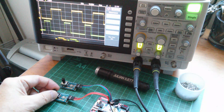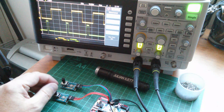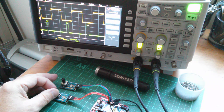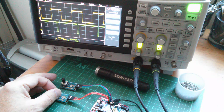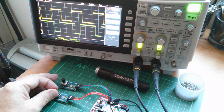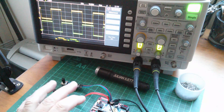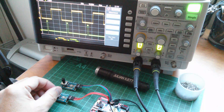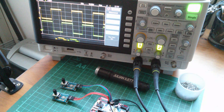I've got a feeling I've seen this before — on the PIC microcontroller, because I did the same thing. I inverted the output and I seem to remember I had the same issue: go all the way to near zero and it jumps to 5 volts; go all the way to very nearly all 5 volts and it jumps to 0 volts. So this is a peculiarity of the PWM hardware inside the ATmega 328P. It's a bit of a nuisance because that's not going to work for driving a MOSFET — reducing the duty cycle lower and lower and then suddenly having it switch on at full 100%.